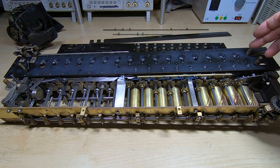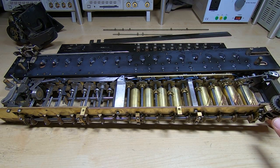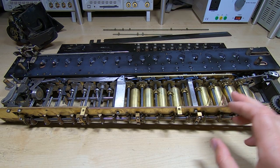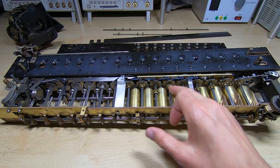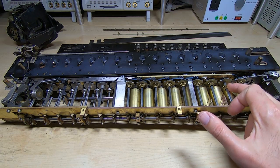But if you get them in the wrong location you'll find that when this lever is released they won't rotate, and that's fairly common for all these different types of calculators. Although they tend to have very different looking mechanisms, they all operate on almost identical principles, so once you've figured out what each of the parts actually is, in general you can figure out how it's supposed to be working and hence start fault finding.